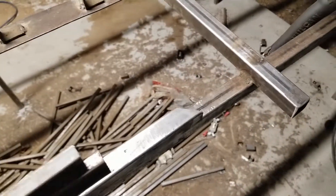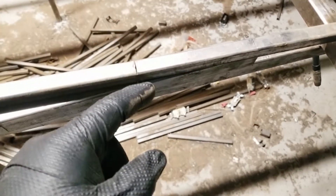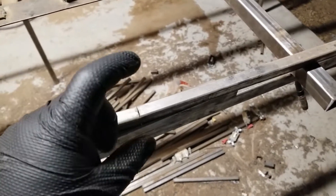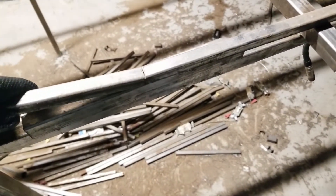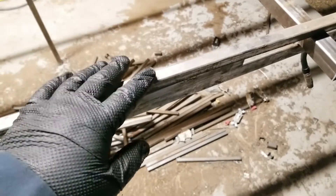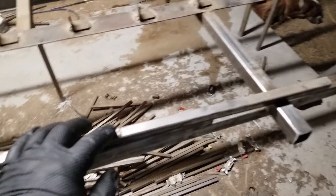We're going to do a little test. I'm just going to lay these down and make a quick bead — not going to make it look fancy, just zap it on, pick it up, and throw it under this engine hoist to see if we can lift it up with just one bead on one side. I'm not even going to weld it all the way around. Just one bead, and we're going to apply the force on the side without the weld to see if I can make the weld fail by overstretching it. If flux core is really an inferior process, it should break almost instantly — probably can't lift close to 60 pounds of force.